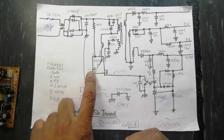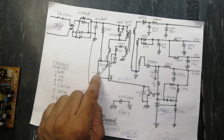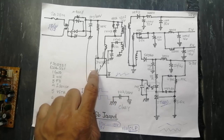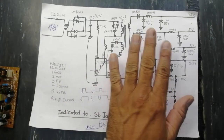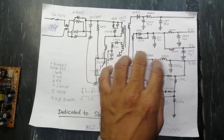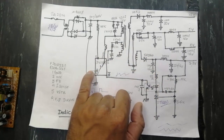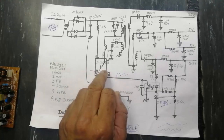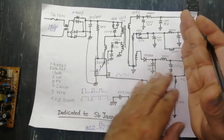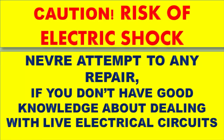At pin 4, a calculated resistor can be connected. If we connect a resistor between pin 4 and ground, it will limit the maximum current from this circuit at a specific level, preventing the circuit from going into an over-current condition.